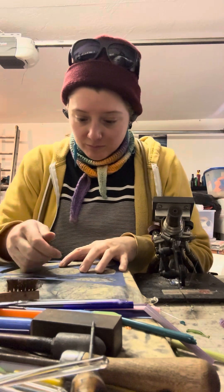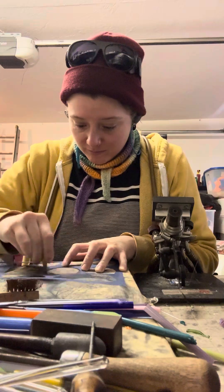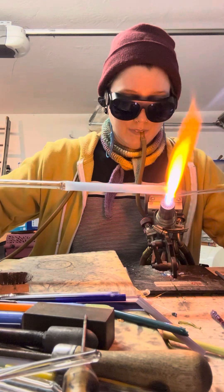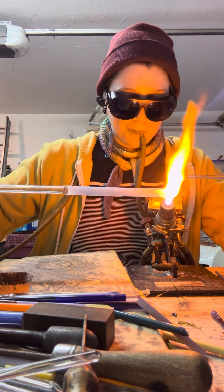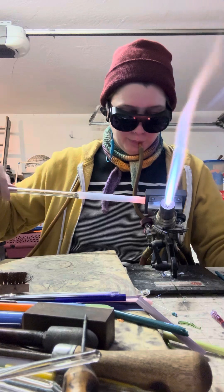It's important to select the size that you want so you know how much tubing you're going to need. What we're looking for is the length of tubing you'll need, which will be your diameter times pi equals circumference — so 2.25 times 3.14 equals 7.065. Here I have a seven inch long piece of tubing that I have pulled from a larger piece of tubing.